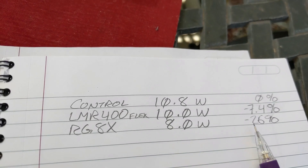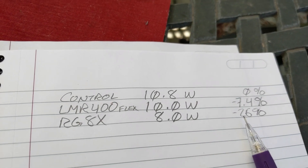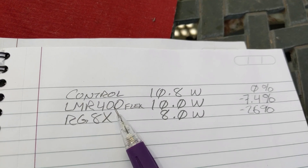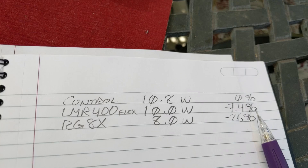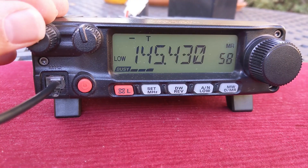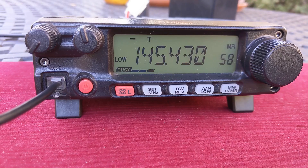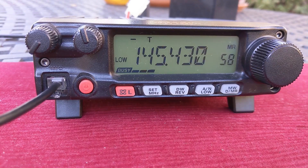This isn't unusual to have in your car or mobile unit either. So I thought the numbers were enlightening. I went ahead and upgraded from RG-8X to get me out to the porch here, and went all the way to LMR-400. In fact, I'm getting UHF contacts now where I didn't before using LMR-400.